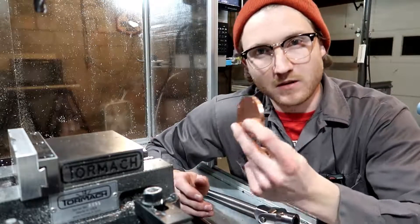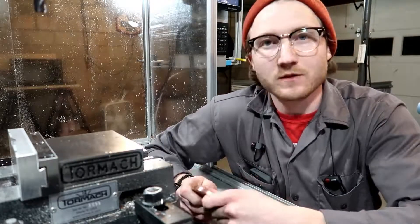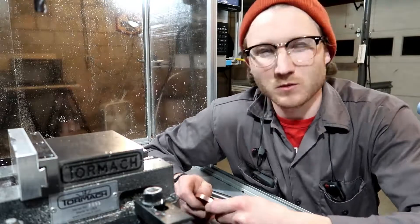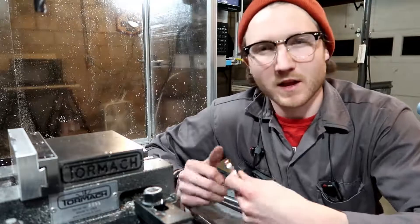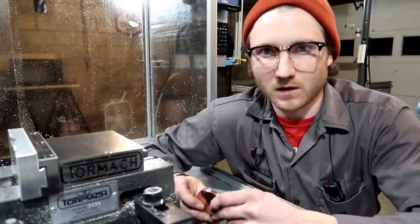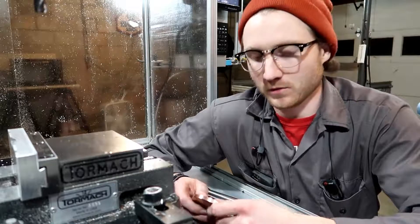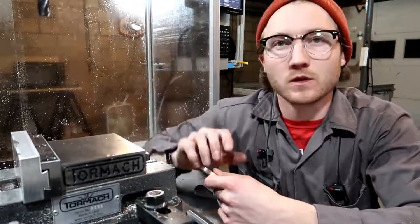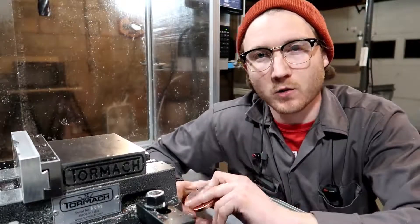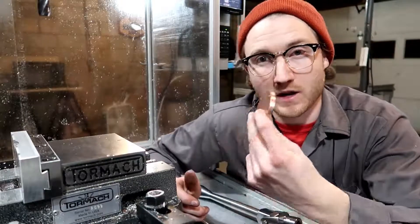So it's kind of weird. I mean this is much heavier, much more dense material than aluminum. Aluminum is like 2.7 grams per centimeter cubed, and this is like 9 grams per centimeter cubed. Which is weird because it seems to machine like it is harder than aluminum — just because of the weight of it. But in fact it's really not harder than aluminum. I also ended up bumping up the coolant on the fog buster, and that's just because I know that this stuff gets hotter quicker. And when it gets hotter, the tool gets a little bit hot, and the part actually got hot.